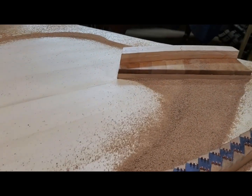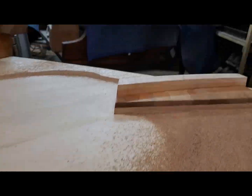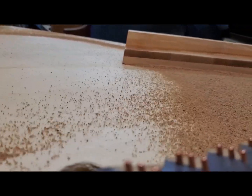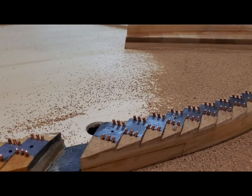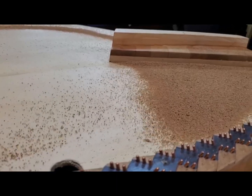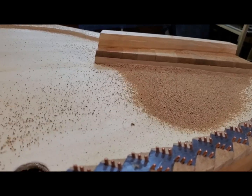We're getting movement at 53 Hz. Nothing over here at 52. Trying 51, 50 — they're kind of bouncing around. 49, 48, 47. Looks like there was more movement a little higher up, around 49 or 50. I think there's a little more movement at 50 Hz.